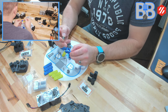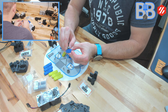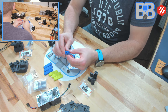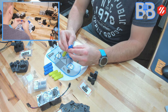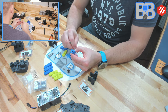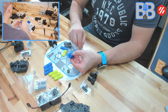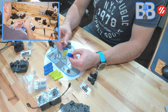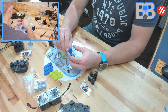The bearing stacks use the same F695 bearings used everywhere else — two side by side to give us about six millimeters — coupled with spacers on top and bottom so they're not sliding directly on plastic. One side of the housing opening is slightly larger. I like to put my bottom spacer in first, then the first bearing, give it a quick alignment, then put the second bearing in, and slide the second spacer in using a tool to get it where you want it.